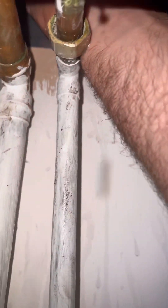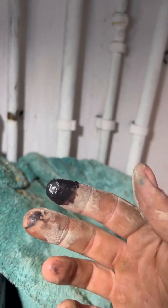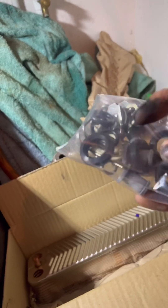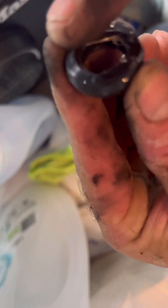It needed two hands just to get it down but as you can see it does fit out — and that's a 20-plate heat exchanger, very very blocked. As you can see by my finger, very very dirty inside that boiler. I'll clear any blockage out with my fingers — any filings I could feel. Then we get the pack out and as you can see it's got lots of fibre washers and clips in there. I grease up all the washers, make sure they're nicely greased up so they become watertight.